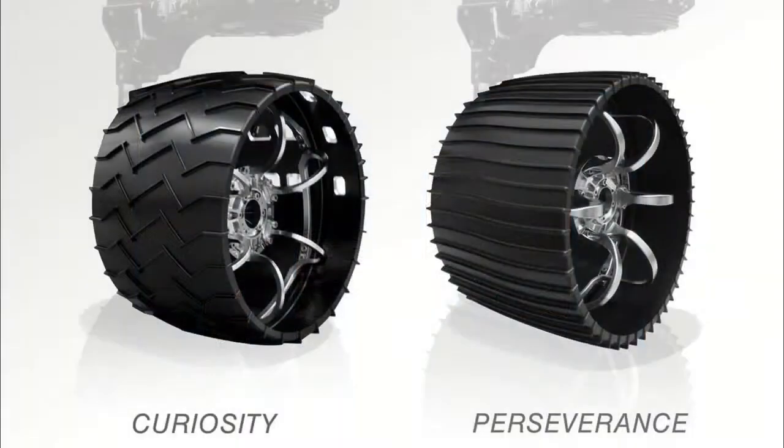With this newest rover, we have an even different design. Comparing the Curiosity wheel with the new wheel on the Perseverance rover side by side — size-wise they're pretty similar in diameter, but the width on Perseverance is a little narrower. Instead of that zigzag grouser pattern, you're seeing almost a straight rib with a very gentle sine wave curve to it that allows the rover to drive over different terrains. Keep in mind as you're building your wheel: what is it going to be driving over, and what's the best edge design to help you drive that way? You may end up building a couple of different designs and testing them out.